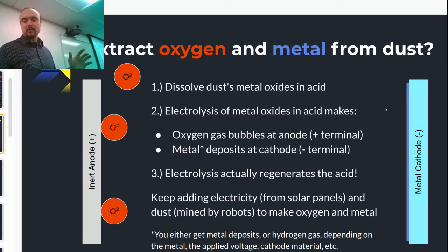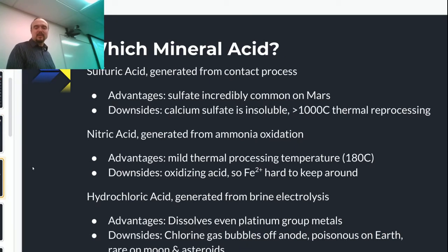In theory, you should be able to make ton quantities of metals and oxygen using only kilograms of acid. Ideally, the anodes are pretty inert. For brine electrolysis, they've gotten it down to milligrams of anode per ton of acid — that's the ratio you want. Even if we can't figure out how to make inert anodes — these usually tend to be titanium coated in platinum or something wacky — even if they're expensive or shipped from Earth, because they're not actually consumed, this thing could conceivably scale. Have people done this? This is the basis of electroplating — it's the basis of a lot of other technologies out there. They've been doing it since the 1800s, so it's definitely something we know how to do.